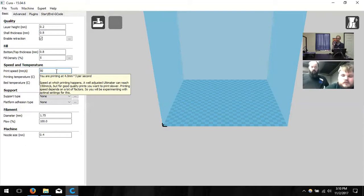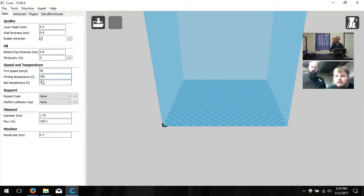Print speed — we like to set these at 50 millimeters per second, about the fastest they can go without messing up the print consistently. You could turn it up to 60, but you may see some skipping in walls and it may look rough. Next, printing temperature — change that to 220 degrees. That's our preferred value to make sure the plastic is molten and lays down nicely. On these A31s we usually use PLA and melt it at 220, though you could have a different range.